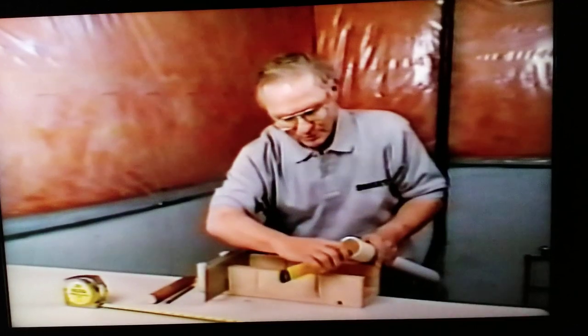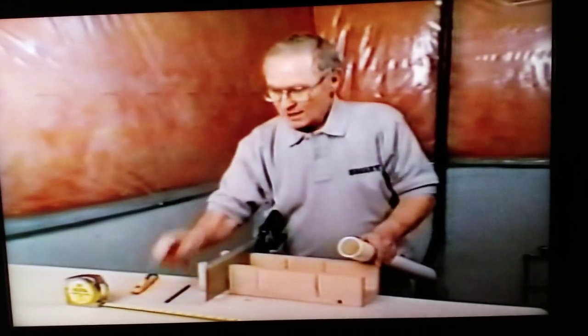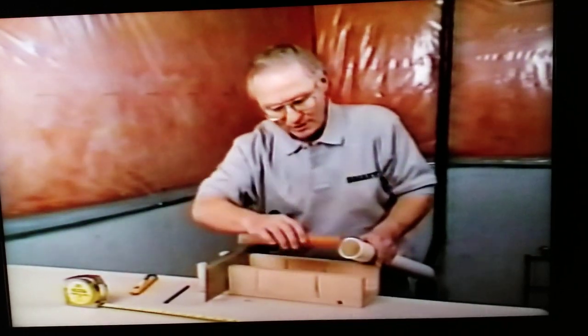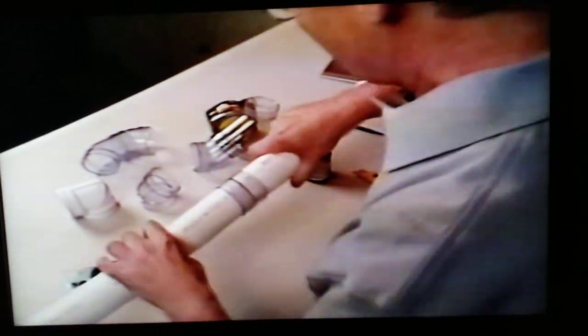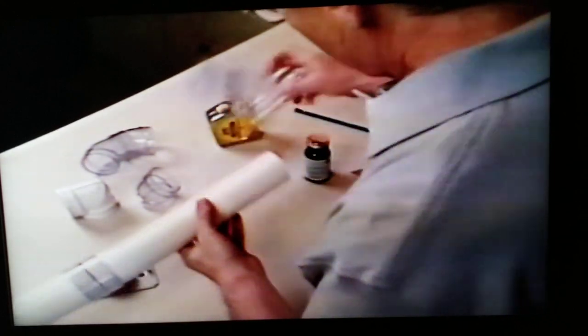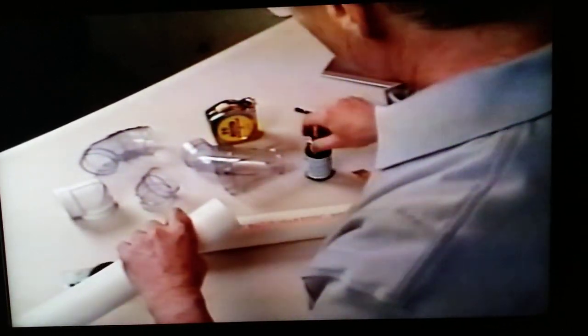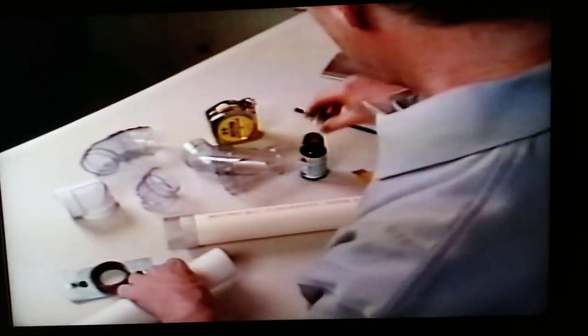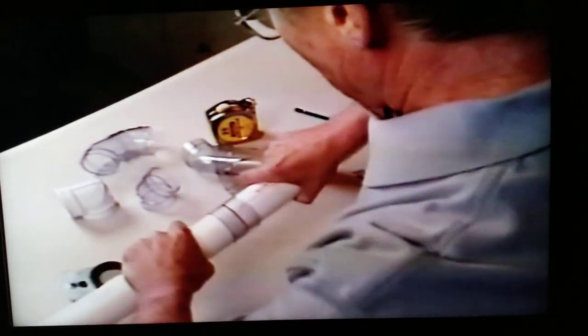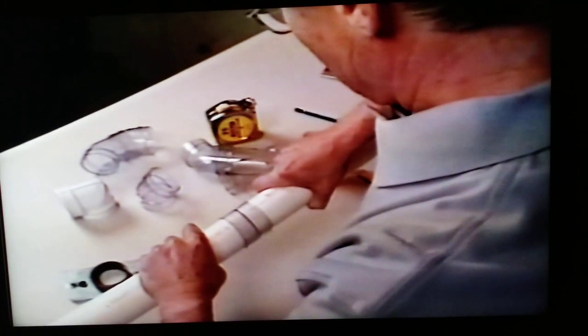A sharp knife will do the job, or glue a piece of medium sandpaper to a small piece of dowel — and really, this is the method I prefer. Test fit your pipe and couplings before you use any glue. The see-through fittings let you check to make sure the pipe is being pushed completely into the specially designed seat — this gives a perfectly seamless interior. Always apply glue only on the outside of the pipe or male part of the fitting, so excess glue is not pushed inside to cause a ridge which might interfere with airflow. Once the glue has been applied, push the pipe into the fitting, twisting slightly as you insert it. Hold for several seconds and a permanent seal is achieved.